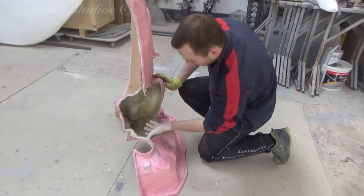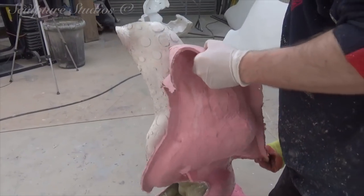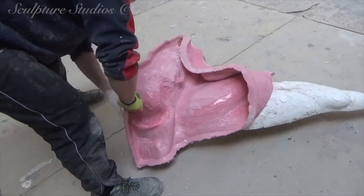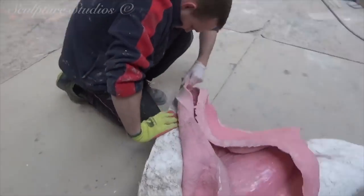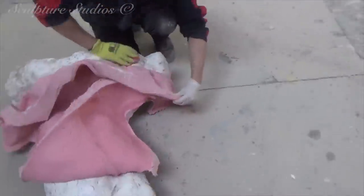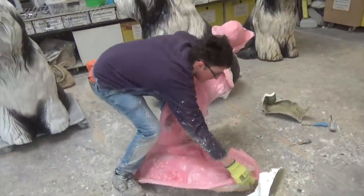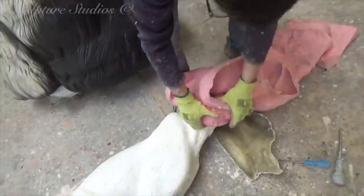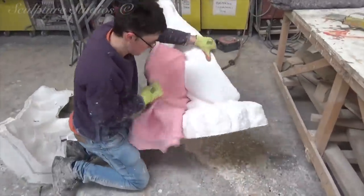We're going in to punch the fiberglass piece out of the mould — extraction is sometimes easier said than done, particularly with awkward shapes like this. We're cleaning up any extra material and sharp edges on each of the fiberglass pieces so everything can start being extracted from the moulds to begin assembly. The casts now need to be lined up, tacked together from the outside in the correct position, so we can reach inside to join everything together along the split lines.